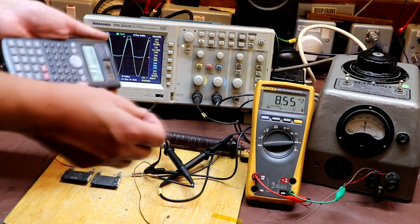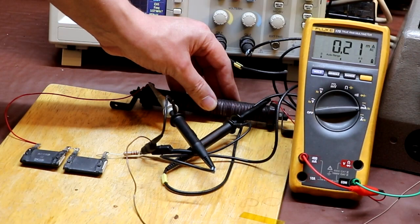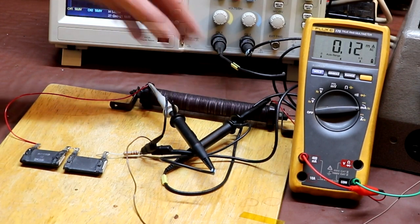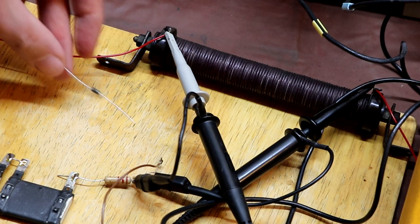So in some ways, having such a big total forward voltage makes this rectifier not as efficient as it could be. And I did wonder if our rectifier was going to get warm to the touch, but no, it is actually still completely cold at the moment. But it appears to me that our copper oxide rectifier is working quite well. I do wonder if our silicon diode will work as well in 91 years.